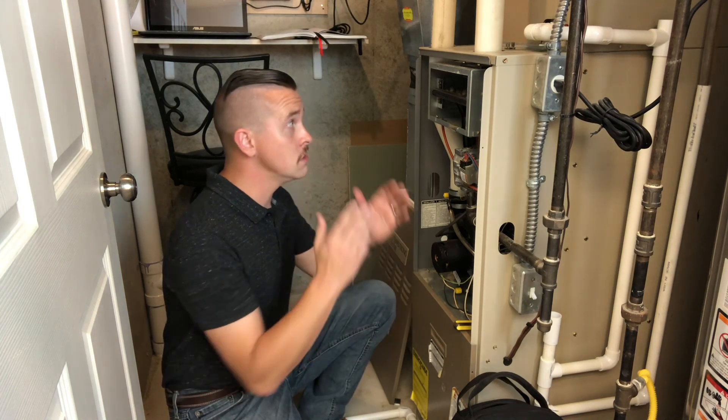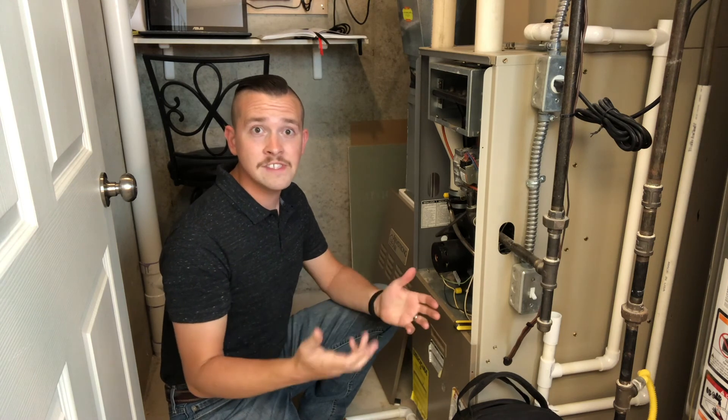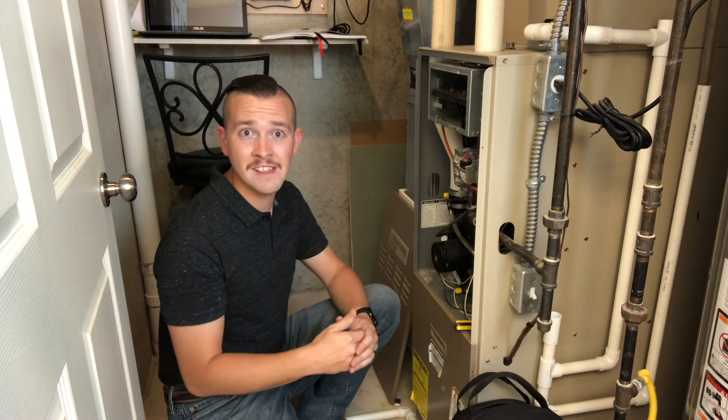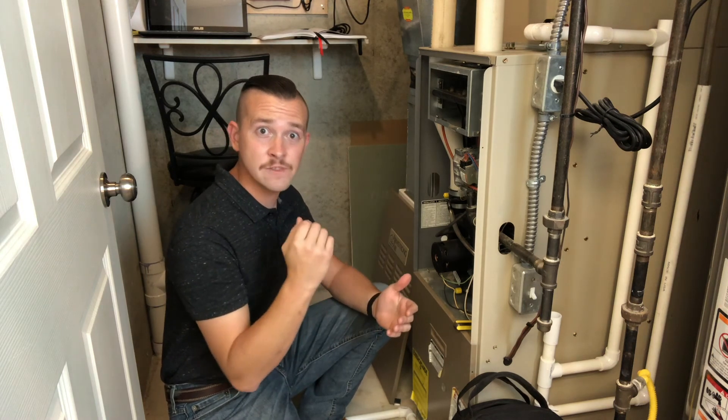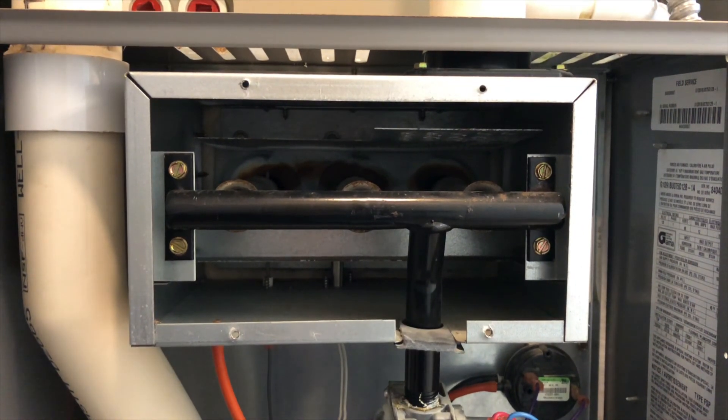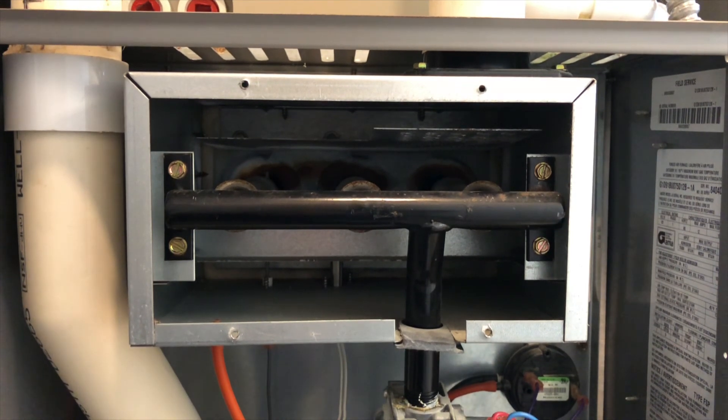The first way to know for sure is you can look inside the burner box and see if the igniter is even glowing. The igniter glows an orange or reddish color because the surface gets so hot it starts to emit light — that hot surface is what lights the burners. The gas flowing past it will catch on fire as it passes that glowing hot rod. Our inducer motor starts, the pressure switch closes, you can hear a click from the circuit board which should be sending power to our igniter. The igniter is not glowing. There's our gas valve opening — you can hear gas blowing — but the igniter never glowed, so there was nothing there to light the burners.